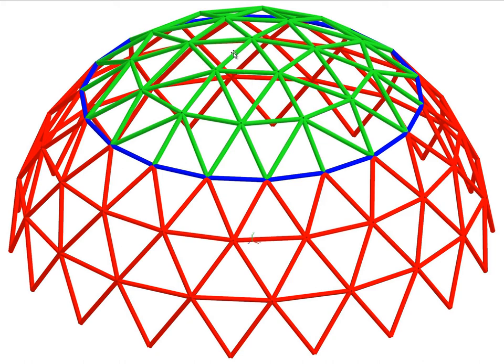Now, we know this member is a little longer than that member because if we just laid out the triangles in the form of a hexagon, that would be truly equilateral, but this point is clearly raised up a little bit out of the plane, and that makes these members a tiny bit longer than those. Now, you may think that's not too important, but if you don't get that length right, you won't have the right amount of crown to this hexagonal pyramid, and you'll appear to have a flat spot on the top of your dome or a spot that sticks up too high. So you've got to get those dimensions pretty precise.